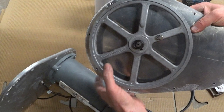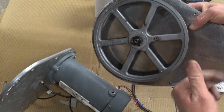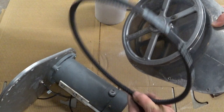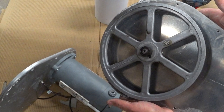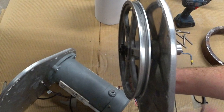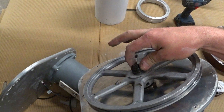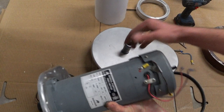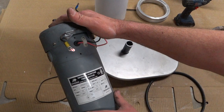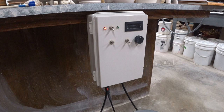It's called a boat hoist — I think it's for some sort of sail rigging. It came with a toothed belt and the pulley intended for something else, so I simply built the pottery wheel around it. I got a 5-to-1 reduction, which means my top speed on this wheel is a little over 400 RPM — faster than necessary. The motor is 1 horsepower, which is about the maximum you're going to get on a standard 110/115 volt wall outlet without going to 220.